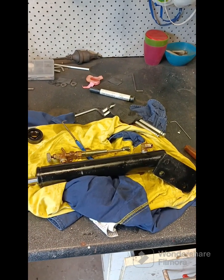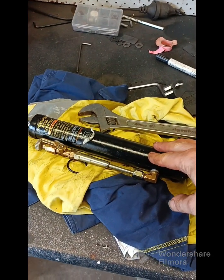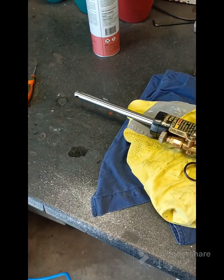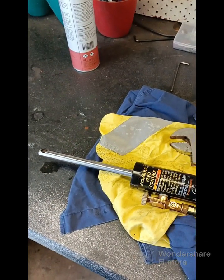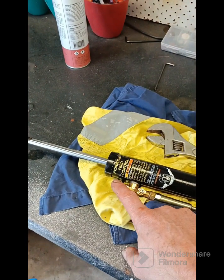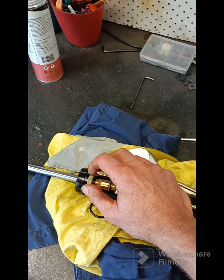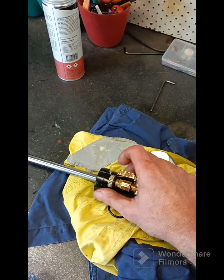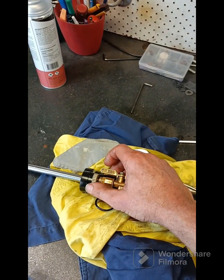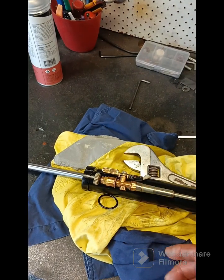These things are too expensive to buy and too simple - not even outrageously well made - but they certainly do the job and I've certainly missed not having it. If it works I'm okay. What I've done is assembled it without any oil, put this end in the vice, and just tested it pneumatically. If it works pneumatically it's sure as hell going to work hydraulically because the oil's a lot thicker and has surface tension. This works even pneumatically - I can close the tap, try to force it, brilliant. Open the tap and they've even got full speed control.